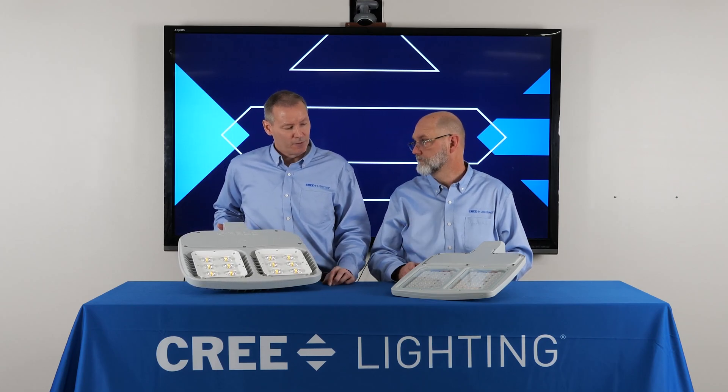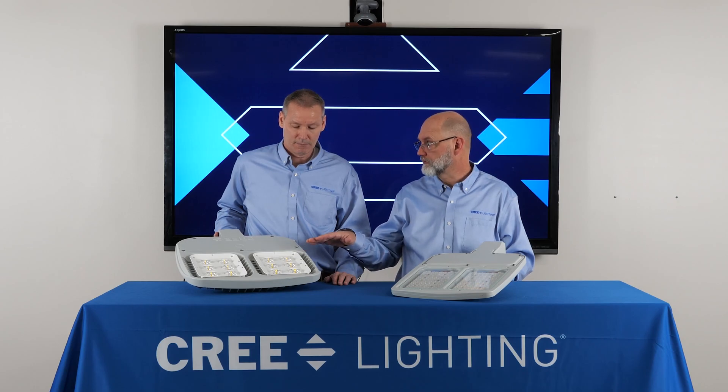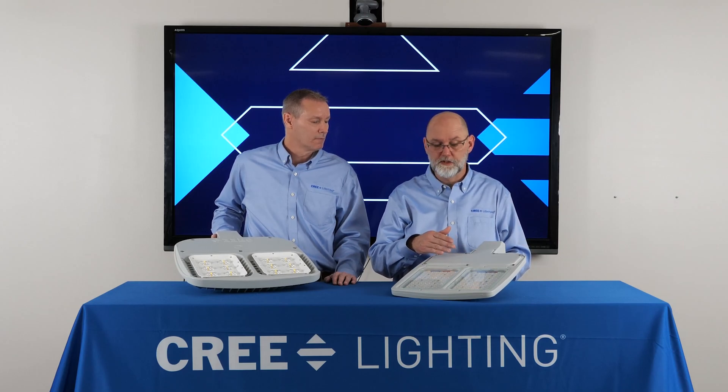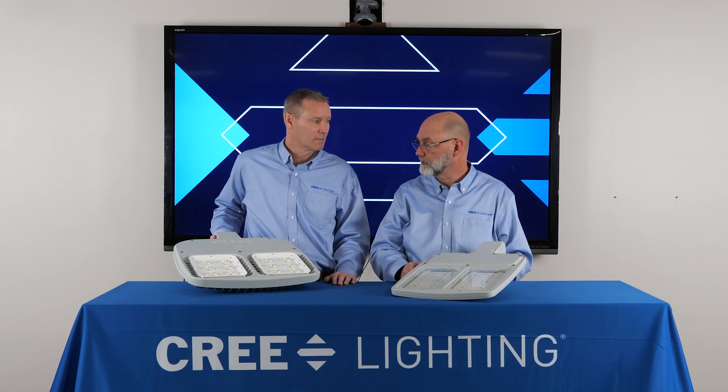Let's flip these over and look at the optics. I have the OSQB version and it's a precision delivery grid. What I remember about this is its high efficacy, great optical control, and lots of optical choices for varied applications. How is the nano comfort technology the same or different? So as we're going from the OSQB to the OSQC and incorporating the nano comfort technology, we're carrying everything over from the OSQB that made it so successful. We're going to see increased and more consistent uniform lighting. The efficacy is actually going up — we're going to be reaching 173 lumens per watt with this family. And we're also going to see really increased visual comfort and an even better experience while standing well under the fixture.